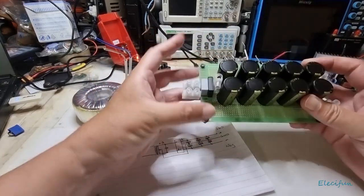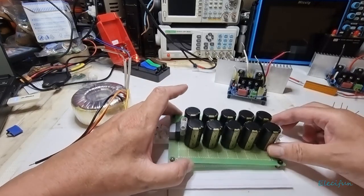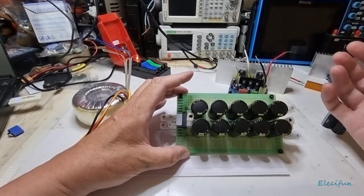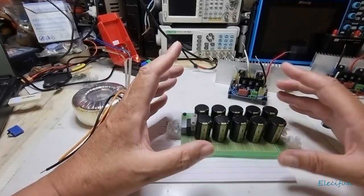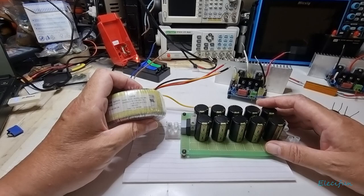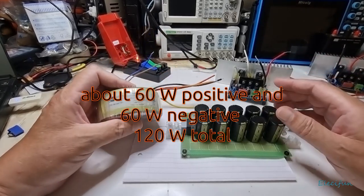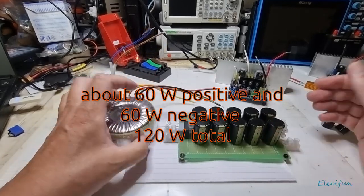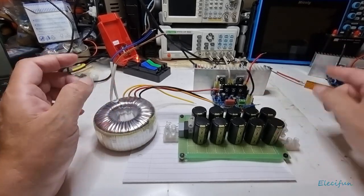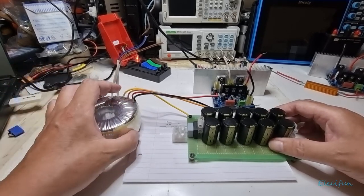Building these unregulated power supplies is so simple. Some may ask why not use a regulated supply — put 30 or 35 volts in and regulate down to 25 volts. The issue is that regulators are only good for a certain amount of current. With an unregulated supply you're regulated by your transformer: at 18 volts with 3.3 amps per side, this is a 120 VA transformer — more than enough for this amplifier. It can only supply what it's rated for, which is why you fuse it properly.